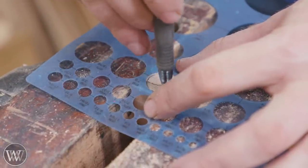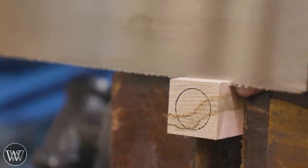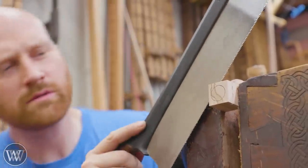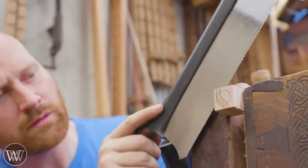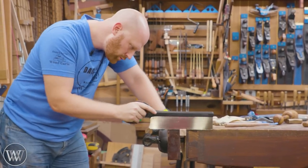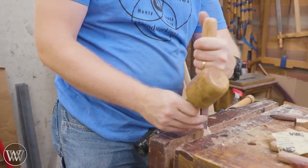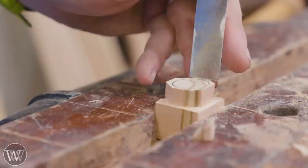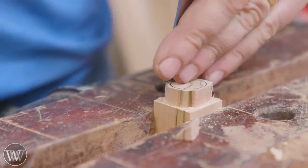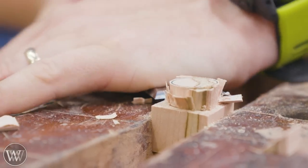For this I'm going to be using a pin because it lets me know the pin has to stay - I'm going to go down to it but I don't touch the pin mark. Then, just like we did with the tenon before, we're going to cut down to the shoulder. Get close to it, but stay away from it - you can always cut off a little bit more. I'll eyeball the depth, turn it around, and chisel off the excess. This gets it really close to that line - I can take off quite a bit by chiseling it. You're going to have to be very careful of the grain direction and make sure it runs smoothly rather than running into the tenon.